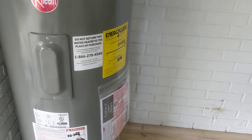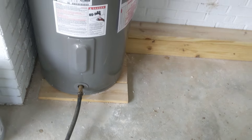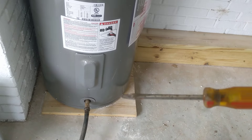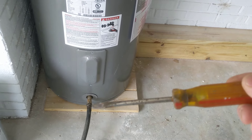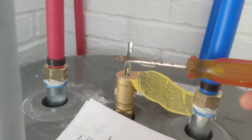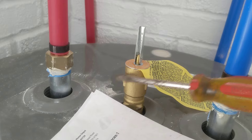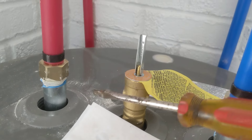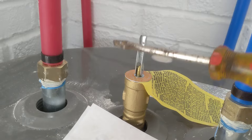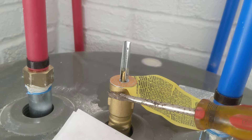If you are going to flush out your water heater, I'll just put that in this video. If you're going to flush it out, you would hook up a hose just like we did and open the drain. But you would leave the water supply on and you would leave the relief valve closed. Do not touch this valve if your water heater is old. I would never do this to an old water heater — you will end up having to replace it.